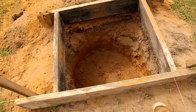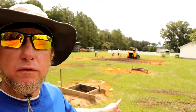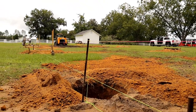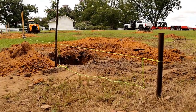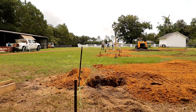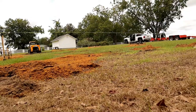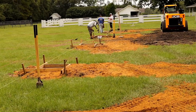I didn't like the idea of every post being a different elevation, so on the front I've done all the same elevation. On the back, because of the slope of the hill, I've dropped it 15 and a half inches, and then we'll make all the posts in the back 15 and a half inches longer. This building is a 40 by 100. We've squared it up, got a string on this side and a string on the back, 40 foot parallel, and pulled our X measurement to get it square and got our corners.